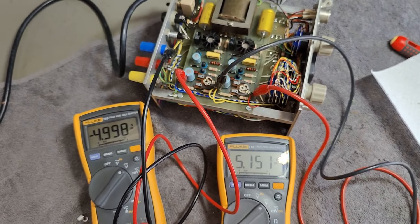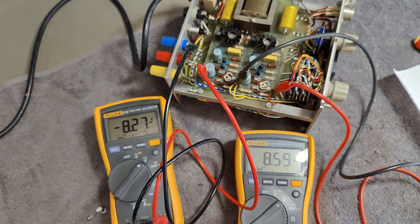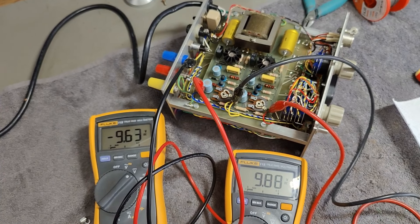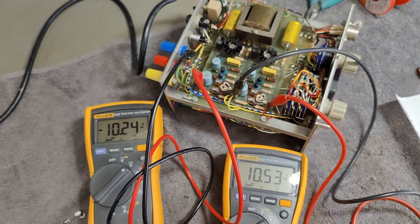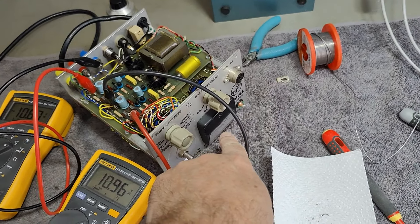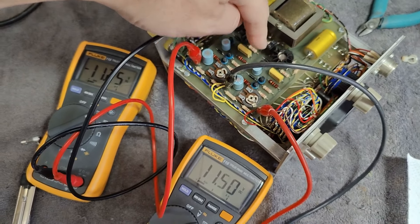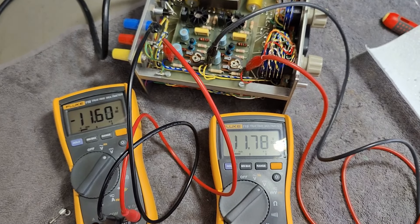This is not exactly what I expected — this kind of unstable behavior is a little bit weird. It's supposed to be plus or minus nine or maybe ten volts. The power supply is just behaving really, really badly. It's using 10 watts and at the moment my meter is fully hammered to the negative side. This power supply is not good — the way it's just super, super unstable.